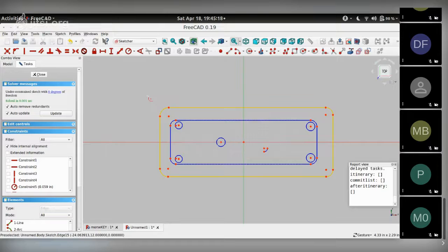Yeah, I think it was the other way around. If you change things in KiCad and import it into FreeCAD, it'll overwrite your existing constraints. Although I've never tried that, because once I fix constraints, I don't want to move them around. It's usually the other way around. I would move things in FreeCAD and then import them into KiCad, and not the other way around.